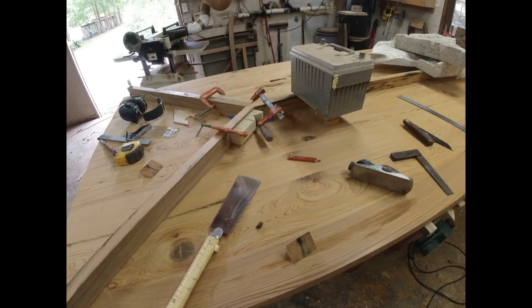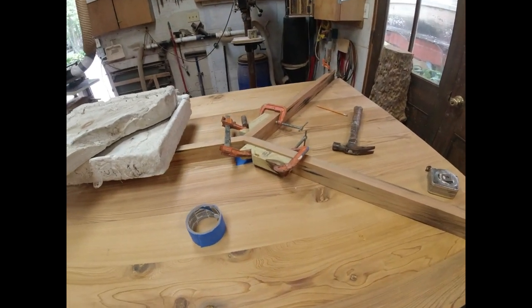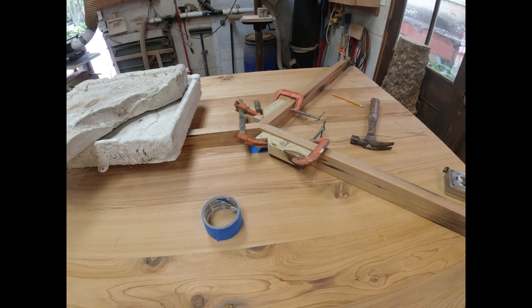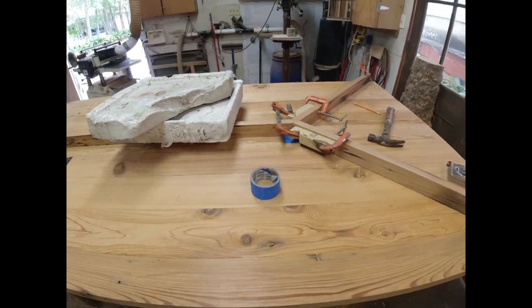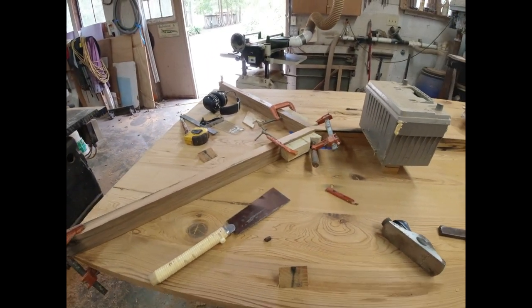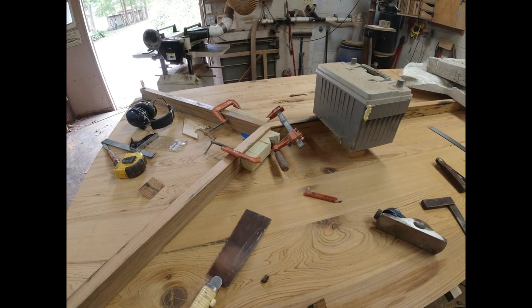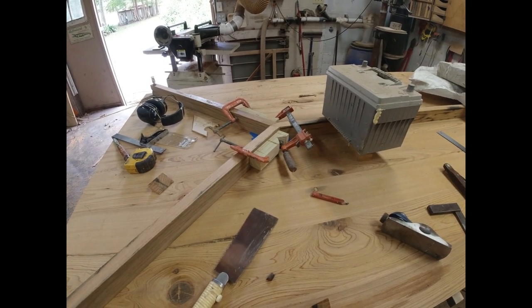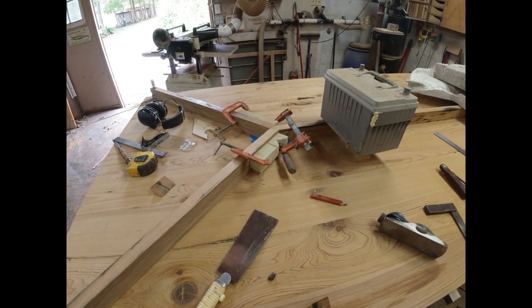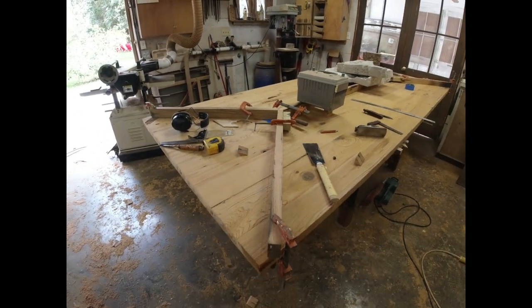Both ends are fitting pretty well. It didn't happen first time — back and forth through the miter saw until I got it where I liked it, and I have a way to clamp it. I've got some blue tape so the glue won't stick to the table. I'll mix up some epoxy and glue them. This will be a very weak joint initially until I either put some dowels in it or route out some drop-in tenons. It'll have to be very strong because people will have their feet on it and be pushing on it, so we're going to brace it. Time for glue.